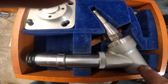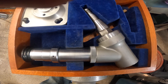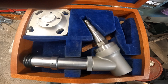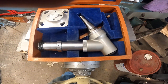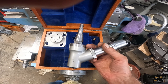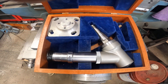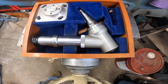The one way you can use an optical center finder on a Bridgeport is to slide it in one time and use it one time. You make a tiny drill mark, don't move anything, put the center finder in the spindle, center it, take it where you need to use it, and then you're done when you have to change to a tool — one shot. This Perkins Elmer unit — at the time just absolutely super expensive — Perkins Elmer made the mirror that had problems with the Hubble Telescope. This is a Moore accessory, quite rare, the early version, 50 power.